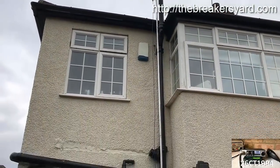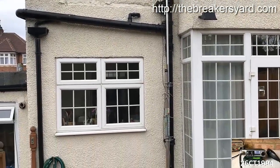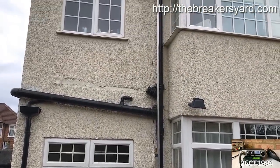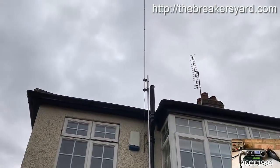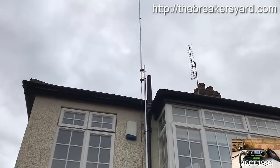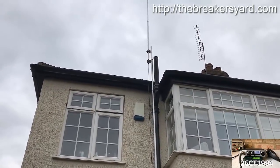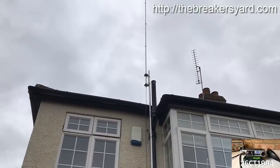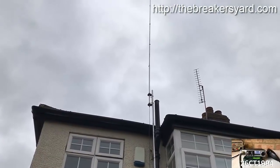It's a chance to show you the aerial anyway. As I say, it's a Venom half wave — about 35 feet. It's one of the cheapest half waves. To be honest, that could be part of the reason I'm struggling so much with the SWR. But I do have an aerial matcher which I'm going to utilise — I don't want to really keep it in line the whole time, but just to get things fired up and working again. I've got the coax connected to the antenna, so that's an important part of the process, and I'm going to go and test for signals now.